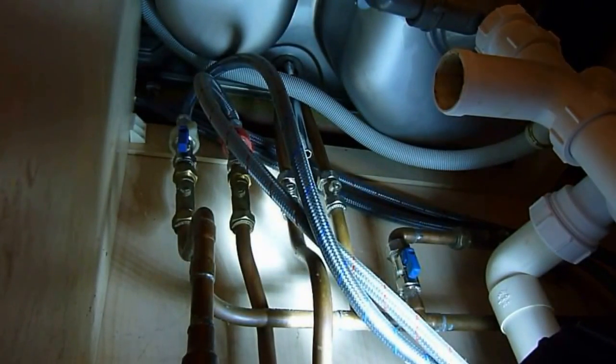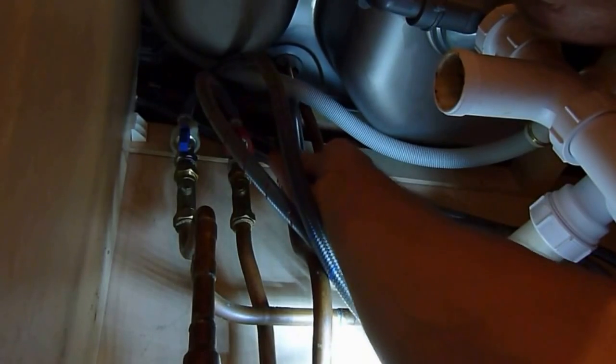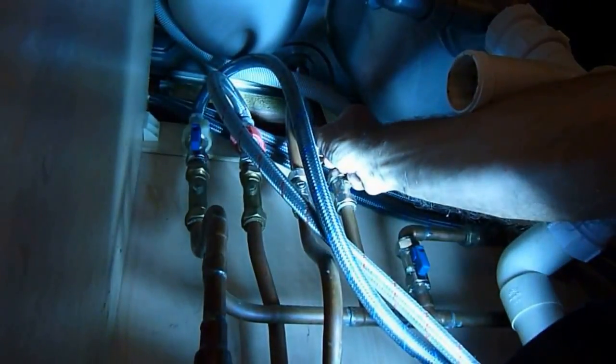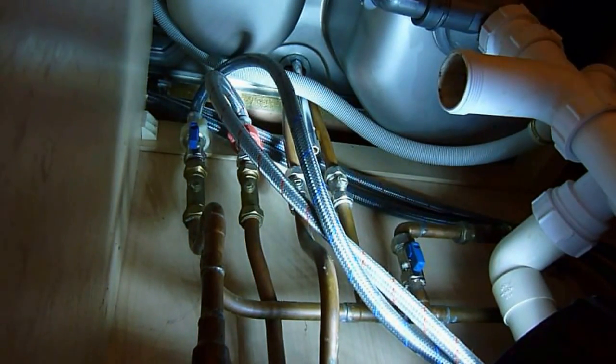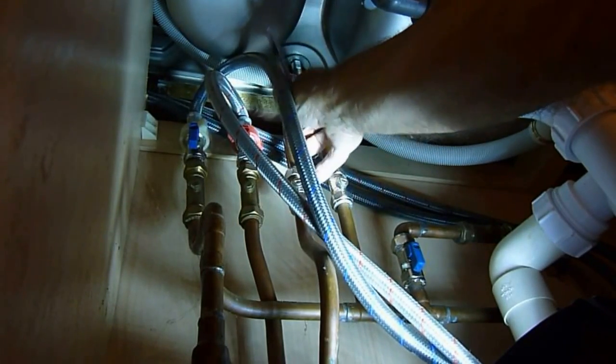You can see the box spanner going up onto the nut - it's a bit awkward but you can just see it engaging the nut. This is the one we need. It's got the whole horseshoe arrangement which is quite common on these under-sink jobs, and you've always got the waste nut and waste pipe running right in front of it. Get it on and then we should be able to undo it - it's a nice tight fit in there. Get a little tommy bar in there and twist - as you can see, that's come undone easily.